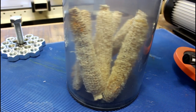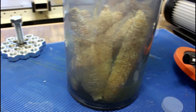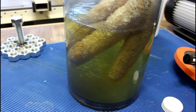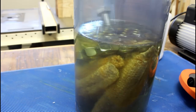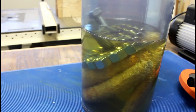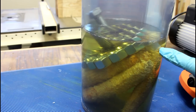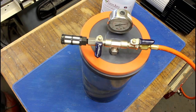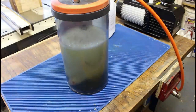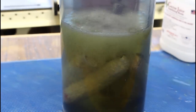And then we pour in the stabilizing resin. We're going to test out our weight here. It's a little cattywampus, but it's not the end of the world. As long as they're underneath the level of the resin — and they are. All we need to do is put the lid on and turn on the vacuum. You'll see this dial here start to draw a vacuum. And we are loaded with bubbles, which is a good thing. All those bubbles are air in the corn cobs being pulled out and vacuumed out of the chamber. This process will probably take a good four hours or so.